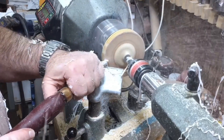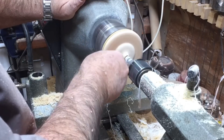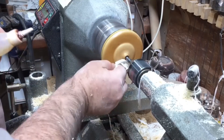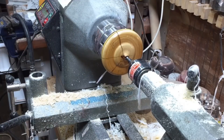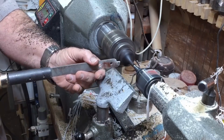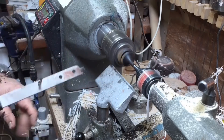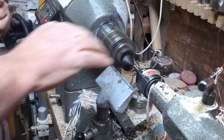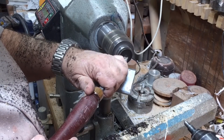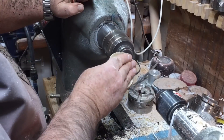I use the recess I made to turn around the lid and now I'm creating the shape of the lid I want. I'll do exactly the same thing — sandpaper, Yorkshire Grit, then Obi oil. From an old project I've got a leftover piece of Black African wood — it's really hard wood — and this parting tool takes it off like nothing. We cut it, polish it, machine it, sandpaper it, Obi oil — everything the same way.